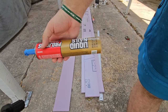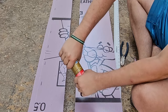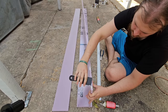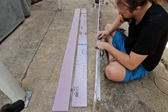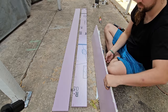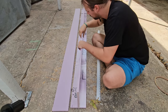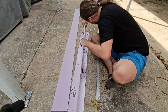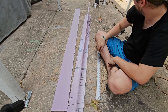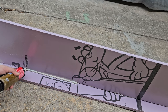Next, we're going to need some liquid nails. I chose liquid nails because it's not very reactive and there's minimal foam shrinkage when applied. In order to get the look of a beam, we need radius corners at the web-to-flange connections, so we're going to need a lot of liquid nails. I'm using a little putty knife to apply it to the edges. Once it's coated, I line it up with the center line I marked earlier and slowly lower it down from one side, making sure it's nice and straight. It was actually able to hold itself up with just those little wire clippings, which is a really good sign. Once it's straight, we can start adding more liquid nails to get those radius corners — I ended up fashioning a little jig out of leftover foam to get a consistent radius.